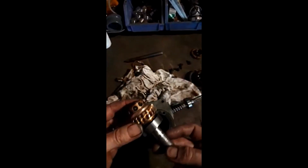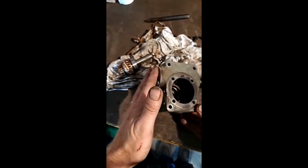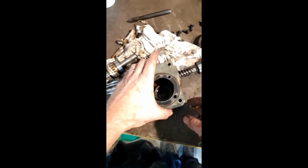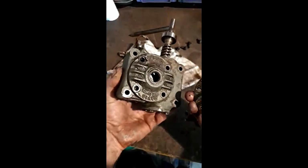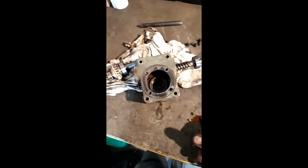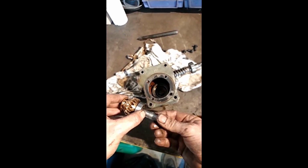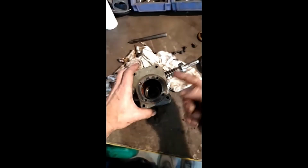So I don't think you're going to get another one of them off the shelf, given the age of this. The only thing I can do for a temporary fix possibly is, this looks pretty much symmetrical. It's got a blanking plate on the end there, which had a screw in it, and it's got the same plate on there. This is the same top and bottom with the plate that goes on. So what I'm thinking of is reversing it. However, if I reverse it and put this in the opposite way, well, it should be okay. If I pop that out, pop that in that way, put that back in, that means it'll turn the opposite way.